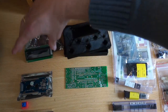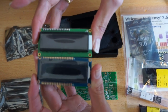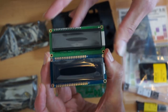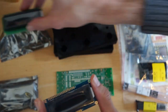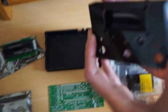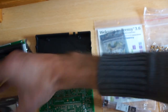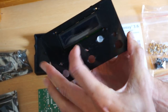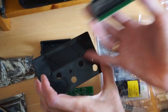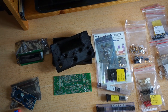There's one thing I need to explain about the displays. I have here 2 displays — this one is from ByDisplay from China and this one is from Adafruit. As you can see, the boards behind the displays are exactly the same size and the holes are in the same position, but there is a difference in the size of the bezel. Therefore I have 2 designs for the top bit of the enclosure. This one is for Adafruit, and you see the Adafruit display fits really nice and tight. But if you put the ByDisplay one in, there's actually quite a large gap on the top and bottom. So you will have to decide which components you're going to buy.